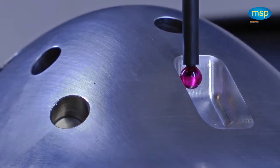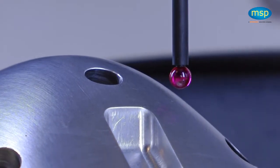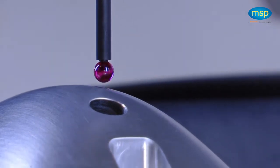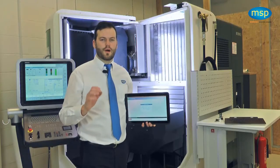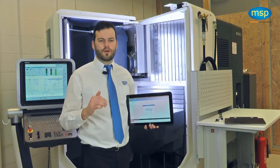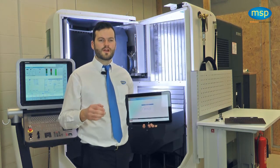Notice the fast single point probing at a variety of surface vectors. Also, the large search distances can accommodate for any large alignment error. NC Perfect Parts automatically synchronizes with the controller at the start of the probing program. It is now waiting for the data to be transferred to the tablet once the program has been completed. From this data, an alignment is automatically calculated to remove any setup error.